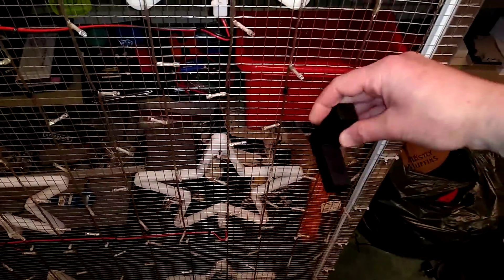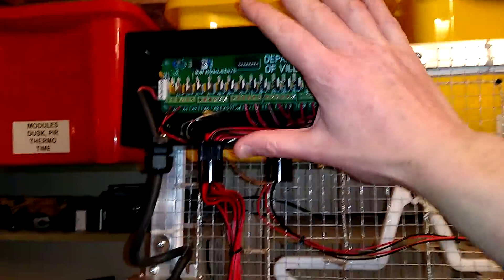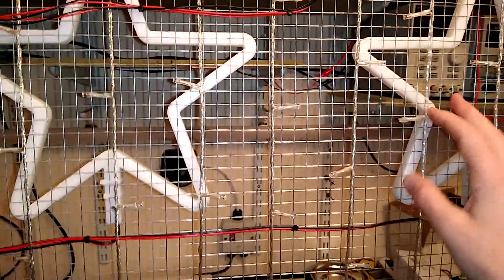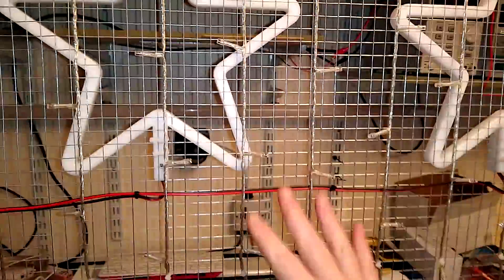The base has a bit of reinforcing metal plate for rigidity, and it's designed to take feet that stick out so you can actually put feet on it for a freestanding effect. And that is more or less it — you just plug it in and it goes. Because everything's configurable — it's a universal frame, universal power supply, and universal controller — it means that after this season, these stars can all just be cut off with a few cable ties, maybe leave the light curtain and the border, and then for next year put a completely different fill. It means it's completely customizable from year to year.